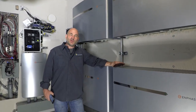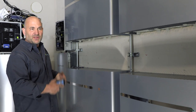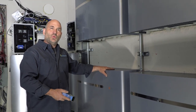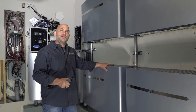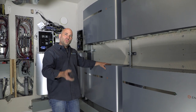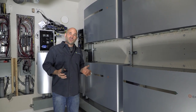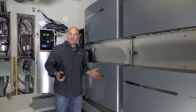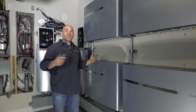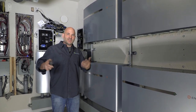The interface systems create a microgrid. Let's assume right now we're sitting here with 40 kilowatt-hours worth of batteries and the sun's out and shining — the batteries are charged. The utility grid has gone down. Well, your batteries are topped off, so the Enphase microinverters on the roof are constantly in communication with these batteries, and they say the batteries are topped off but we have requirements for loads in the house. The solar on the microgrid allows the operation of all the home circuits — the 120 and 240-volt circuits — to function. We're not even draining batteries yet, not even touching battery consumption. The microgrid is making tons of power and you're using that power instantaneously.